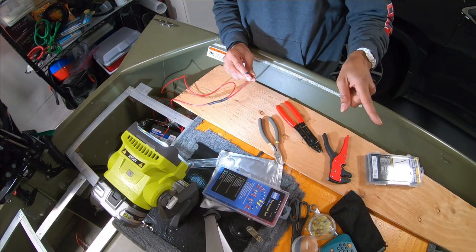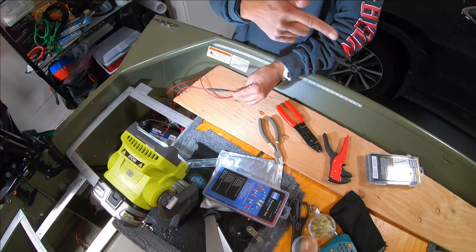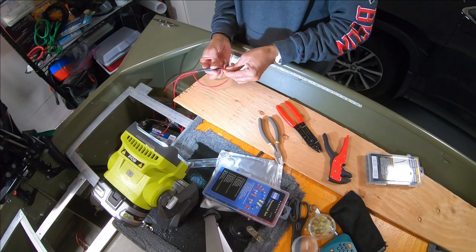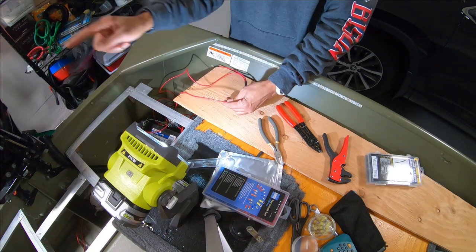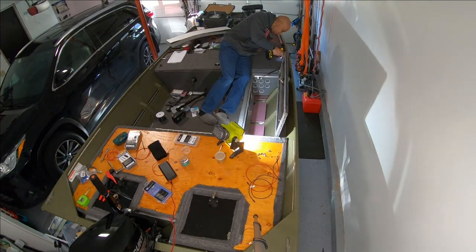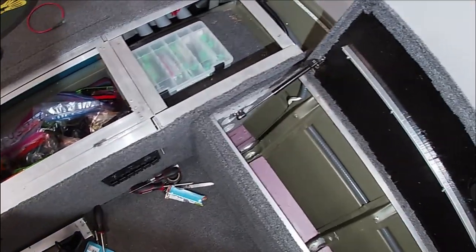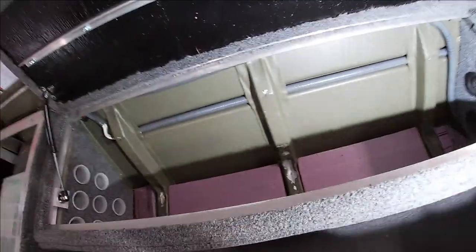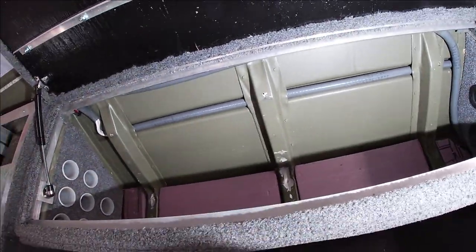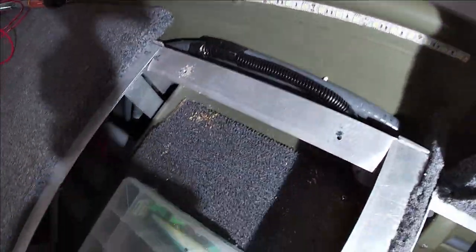I've got my connector for the courtesy lights joining up with the rear LED light, and I need to connect that to the wire running to the LED on the other side, then run everything to the front of the boat. I've already moved the sidewalls to the rod locker and removed the decking over the middle bench to access underneath and run the wires. I do have conduit in this boat but I've filled it up — no space anymore — which is why I'm pulling off panels. I'm going to run the wires along the wall, tucked up underneath, along the conduit pipe, and ultimately into the area where the switch panel is.